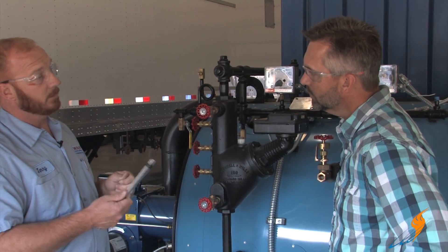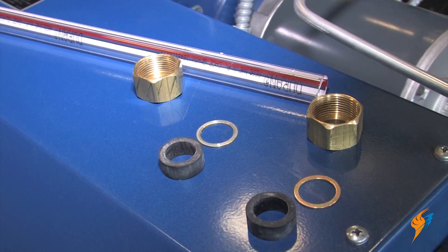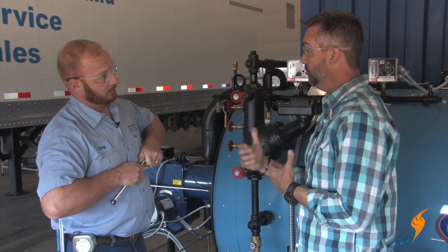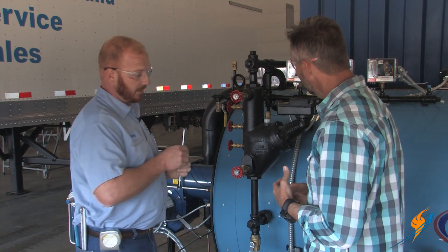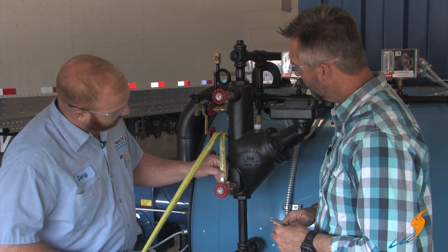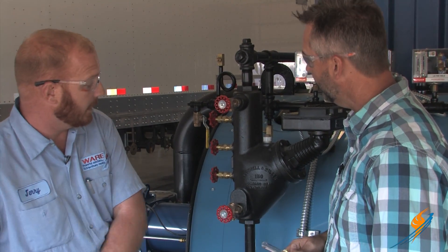On a new glass that we'd be putting back in, we would use new washers. There are brass washers that go in there to protect this rubber grommet when you tighten the nut down. So we've got our glass — measuring it to actually cut a piece of glass. On this particular valve, the stop is a half inch down in there. We'll measure from face to face and add that half inch. So it's 11 inches — add that half — I'd cut the glass 11 and a half inches.